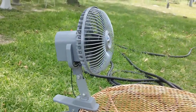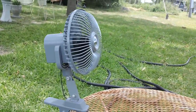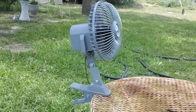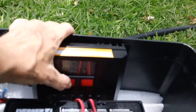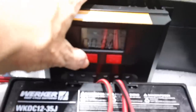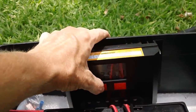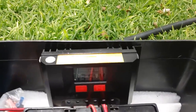Let's hook everything up. Fan is plugged in via the power pole. Let's see if it'll work. Now we're up to 13.9 volts — and voila! We press the button, and now we've bypassed the battery and are working directly off the solar panel. What you'll see is instead of the extra volts going into my battery, it dropped down because 0.3 volts is being used by the fan apparently. Then if I press the button here, it'll show we're bringing in 0.9 amps and we're using 0.8 amps — basically exactly what we're using, so no loss.